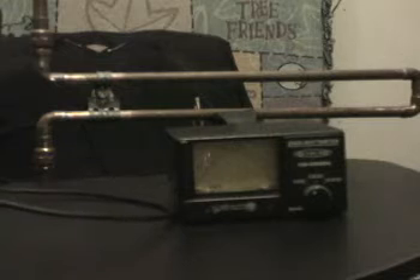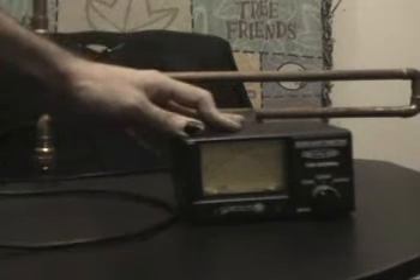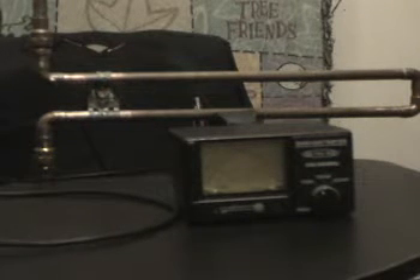That's putting out a relatively good SWR. Let me go up to the upper side of the two-meter band. Notice how that's 1.6:1 — that's a little high. So what we're going to do is move the feed point back until we can lower it. Now we're down to 1.4, then just over 1.2, settling around 1.2:1. Back at the lower side we're pushing out 3 of 5 watts. Now let's go to the 70-centimeter band at 440 MHz. Still only pushing about 1.5 watts reflected, so again you just go and adjust the actual feed point. Let's go back to the two-meter band.